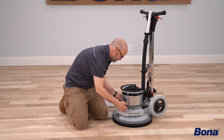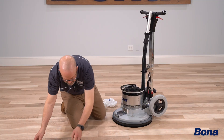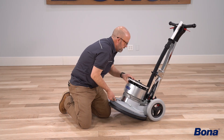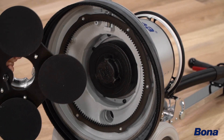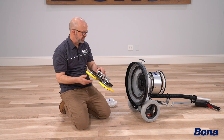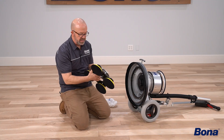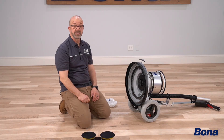We want to take off our weights, and the other reason is that if you have it stored upright with the sanding plate on the bottom, it can actually warp or bend your sanding pads too if it's just static all the time like that. The next thing we want to do is remove our drive plate and take that off. Most guys are going to store this upright in their van, and we don't want the machine sitting on these pads because it won't sit completely evenly due to the weight distribution of the top of the machine. It could give you a flat spot in a pad or actually bend one of these pads.